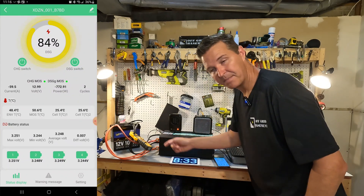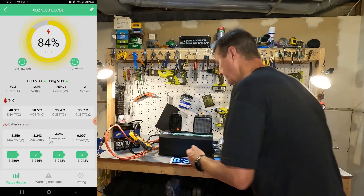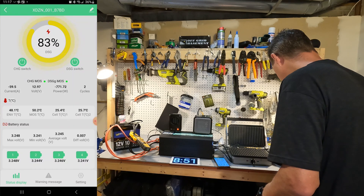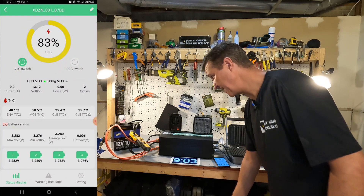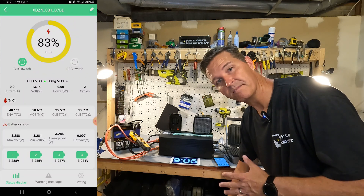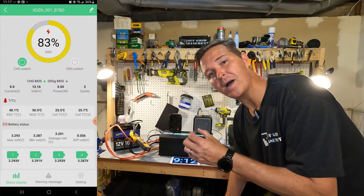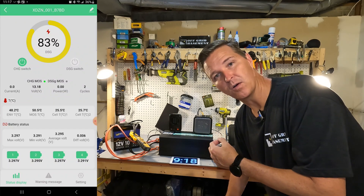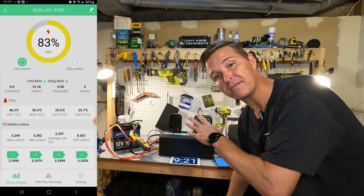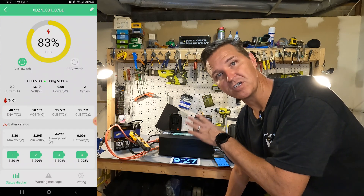Now with the amp clamp on, let's try again to see the actual amperage reading. Turning on the new wave at 1300 watts — it got up to about 170 amps before the battery shuts off. So the high amperage protection works, but a little more conservatively than rated: it says up to 300 amps give or take 50, but it's cutting off around 170. For a battery this small and compact, 170 amps is more than enough anyway, so this test result is just fine.